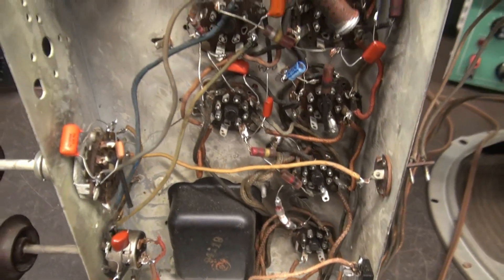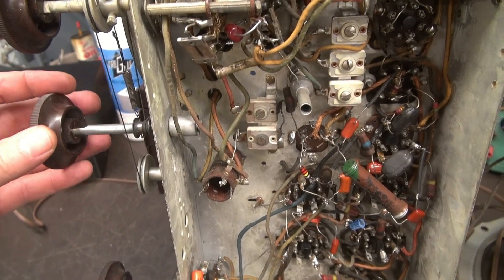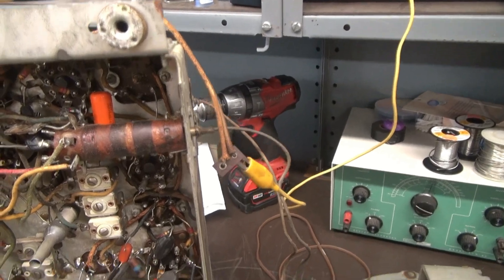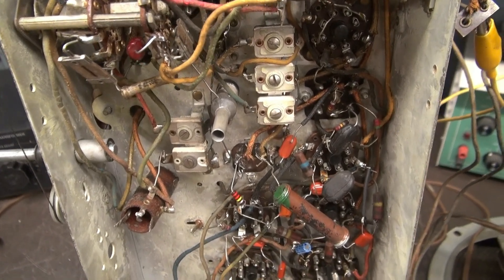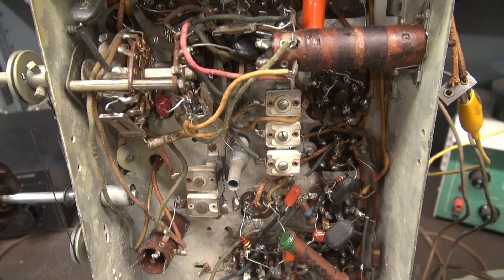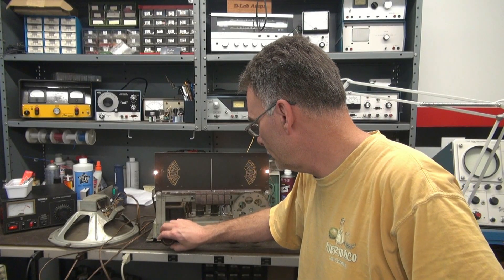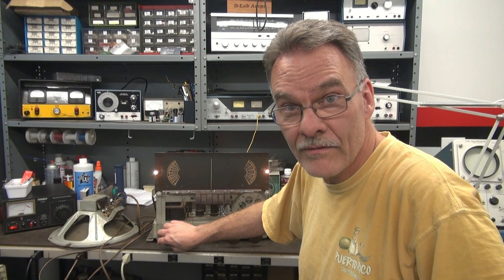Here it is, and as you can see, it's playing. I'm just running that off a jumper wire, about a foot and a half long. So it appears to be very sensitive. My next step is to go through, check all the resistors, and change out the ones that are way out of tolerance. Then I've got to fix that old wiring that's all crusty and falling apart. But it's really coming along nicely — I'm very happy with it so far. Here's the RCA picking up International Shortwave on a foot and a half piece of wire. I'd say she's working pretty good.